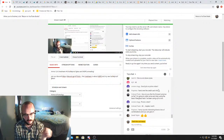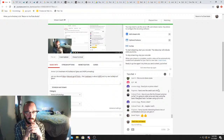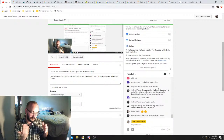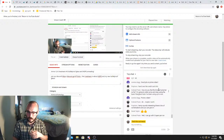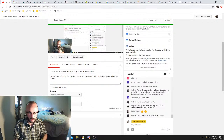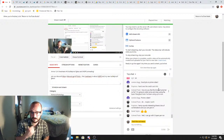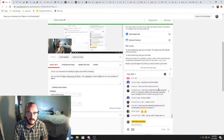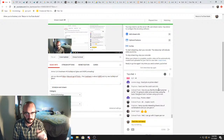But I understand, because of that working time, you don't have a long window. 2 to 3 minutes is not long once you finish mixing. It's more for a pourable resin. It's not made for what we're designing it, or what we're trying to do with it. Maybe you could do an intermediate lamination where you laminate 5 layers, rest, 5 layers, rest. It's going to take more working time for you, and you just build up. But the energy absorbing properties of it might be way better than using an epoxy. So I highly recommend looking into that Simpac. That's why I bought quite a few little sample sizes of it, just to see how well I could impregnate it, as a pourable urethane.